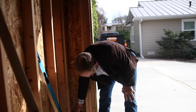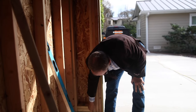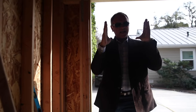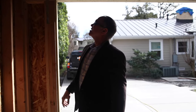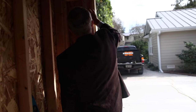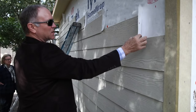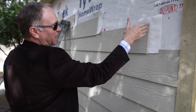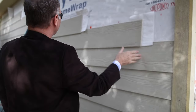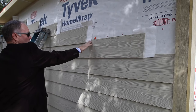And then you tie all this down so it's one unit that's being bolted to the foundation. And it cannot pivot or twist because of all this sheathing that's on there. And then you see these additional straps that tie everything together. This is a really good example of the sheathing that we got to see in the earlier stages. Any moisture that comes in here drips down, and it makes those joints that do not need to be caulked.